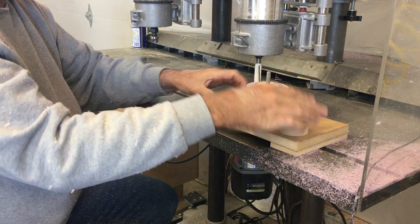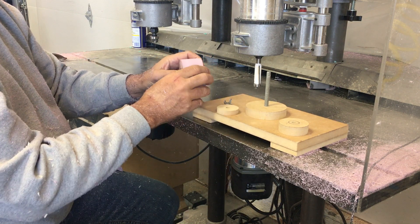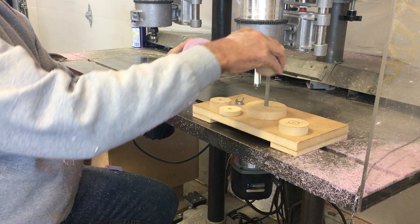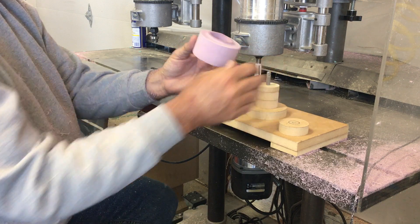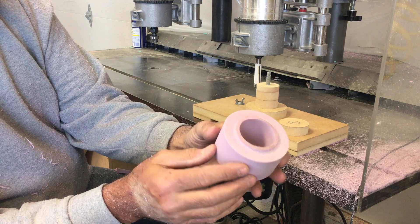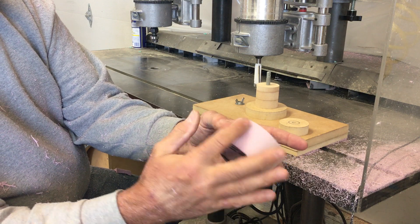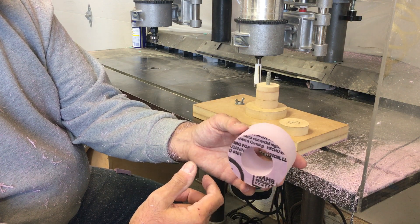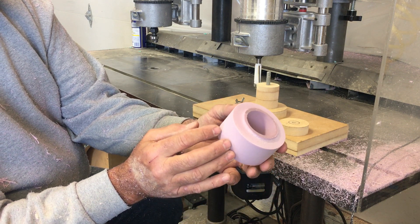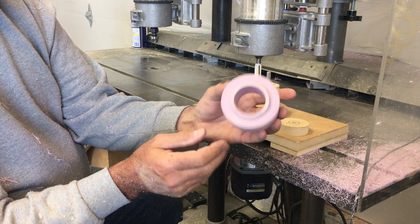Alright, so after those two operations we'll press the plugs out. You can see I've got a blank that's the outside diameter of the cylinder fin portion. I put a little radius land in there — that's where the other piece, the cylinder head, sits on it. The next operation will be to cut the fins on it, and after that it just gets trimmed on the hot wire and it's the cylinder head. I've got a couple other operations to do on some other parts, but we'll come back to this one.